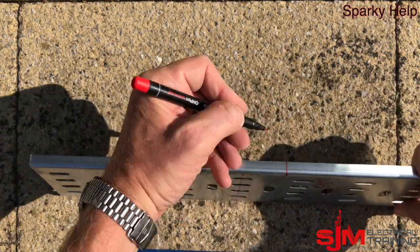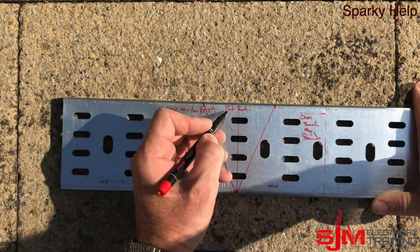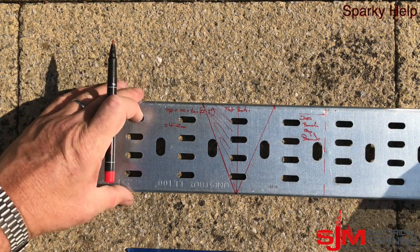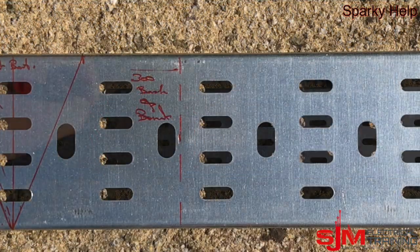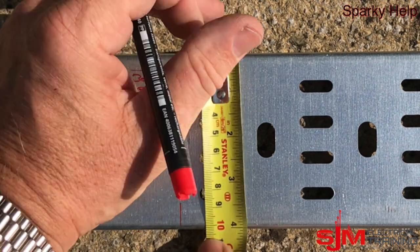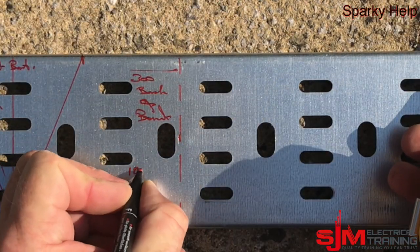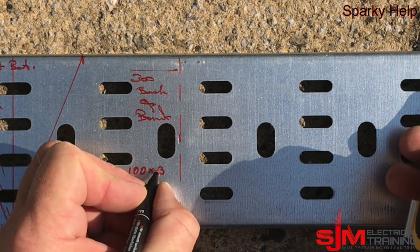Then mark them up on the returns because the flange is going to come out. I like to mark what I'm going to remove. You don't have to remove all that to put a line in, but I like to make it look like a mitre joint — so that's what I'm going to do. Now we've got to decide where the next bend will be. That can be done using an angle or set square, but we'll do it by calculation.